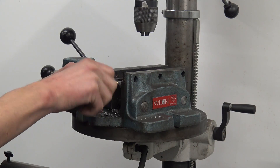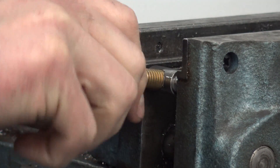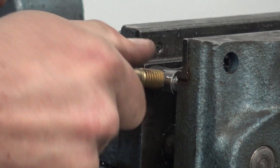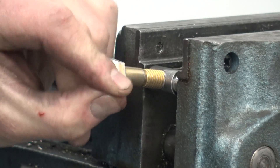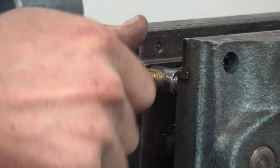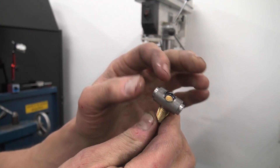Oh, that's a pretty nice fit — holy wow, really nice fit. There's a bit of friction but not a bit of slop. I can't wiggle it at all, but it turns beautifully. It still raised a burr though, probably because of the round bar — you could face that off and create a flat area as one solution. For now, we're going to thread mill them and rock and roll with that. Appreciate the comments, thumbs up, likes and shares — take care, see you soon.